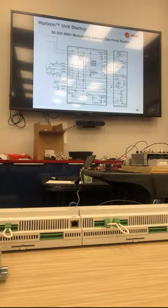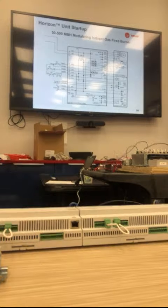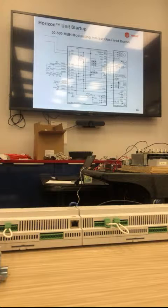Flue extenders, you still... Yes. So with the flue extenders, there's a couple things. The flue extenders are used, one, to get it above the height, and the other is for wind. We have now designed a shield that is not needed with the flue. We can build a wind guard instead of getting the flue extenders, so you don't have to install those monstrosities.